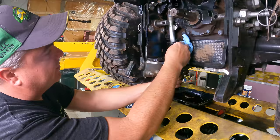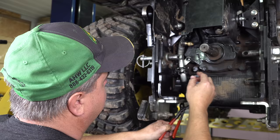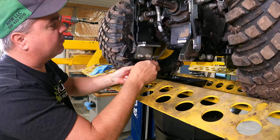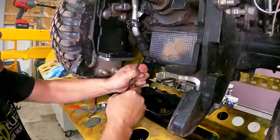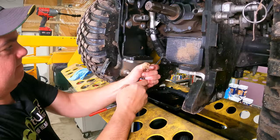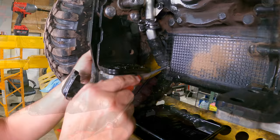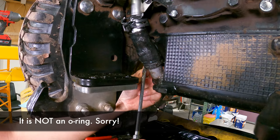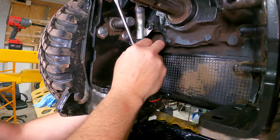I've got both these clamps kind of pinched up here some way against themselves and against another bolt over here. And now I'm going to try to get that hose to go upward. So again, it's a screwdriver job. It's not easy, but it's going upward. There she goes. It takes a lot of my strength in my old age to do that. Okay, and we can see as soon as we got above the O-ring there, that might be getting about far enough. Otherwise, we're going to have trouble getting the clamps up much further. Yeah, that'll probably do it.